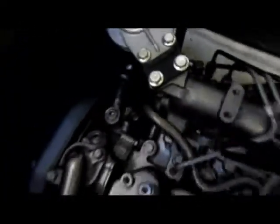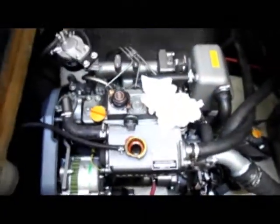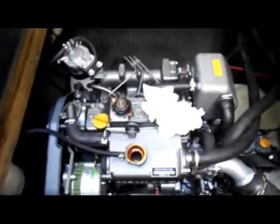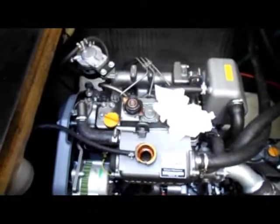Also, we've opened up the transmission and sail drive oil, which looks to be in good shape. Also, when I was doing the initial inspection, we're checking things like valves to make sure that they're stiff or not stiff. And then also we've got high water alarms, general condition to make sure there's no fuel leaks on the injection pump or the injectors. At first glance, everything looks to be quite good on the engine and just what we would expect. Like I said, we'll do some further testing on the sea trial, but for right now, everything looks good.